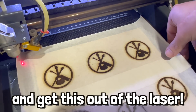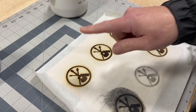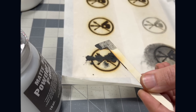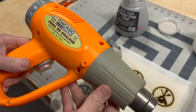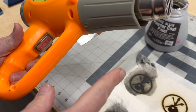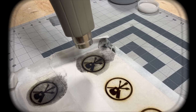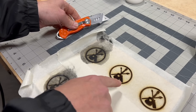Now we're going to get this out of the laser and apply our powder coat. I'm going to start with black and then get the heat gun to see what kind of results we can get. Here's our heat gun, also from Harbor Freight. There's high power and low power and we're going to choose low power and make sure we don't get too close, otherwise it will blow the powder coat out. Make sure it's stuck in there. Let's get white on this one.